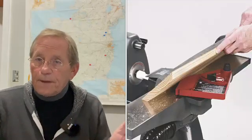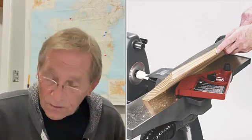John R. had a power station for 22 years and uses it strictly for the jointer — takes up little space and does a fantastic job. Either way you go, I think you're going to be fine. If you have a power station, yes you can run your jointer on it. A Mark 5 or Power Pro 7 does a wonderful job with variable speed. Remember, on the Mark, you're using the lower auxiliary power spindle on the left side of the headstock to power the jointer — it runs 1.5 times faster than the actual motor RPM.